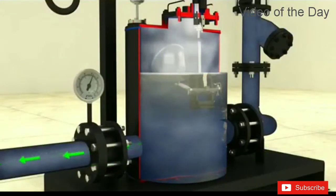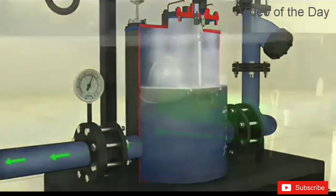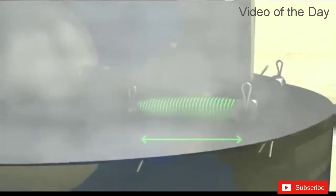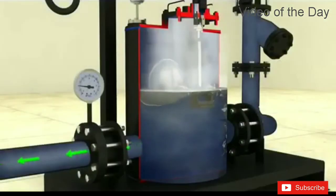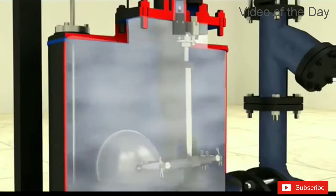As the condensate level in the pump body falls, the float is lowered and the mechanism link is engaged, which again increases the tension in the springs. When the float reaches the lower tripping position, the linkage mechanism snaps downward over center.